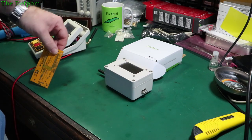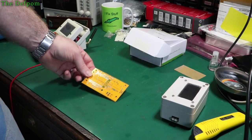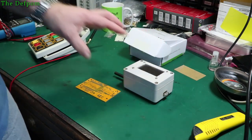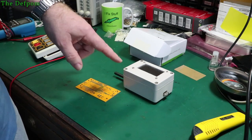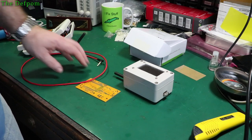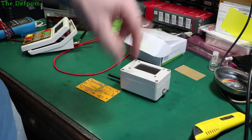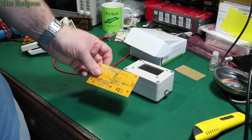Anyway, this board can also work in here. Although I designed it for this originally, it occurred to me that I can actually use this for these as well. So I'm going to make this board up. I haven't actually figured out exactly how to do it yet. I know it's capable of doing it because it's got a lot of similarities between this and this. They do a lot of the same functions. It's got the same networking interface. Instead of having a serial interface going through this cable here through a timer that plugs into the timer normally, that's a serial interface there. This is a serial interface to go to the keyboard controller. So they both have serial interfaces. They're really just a case of remapping the pins to suit this board.